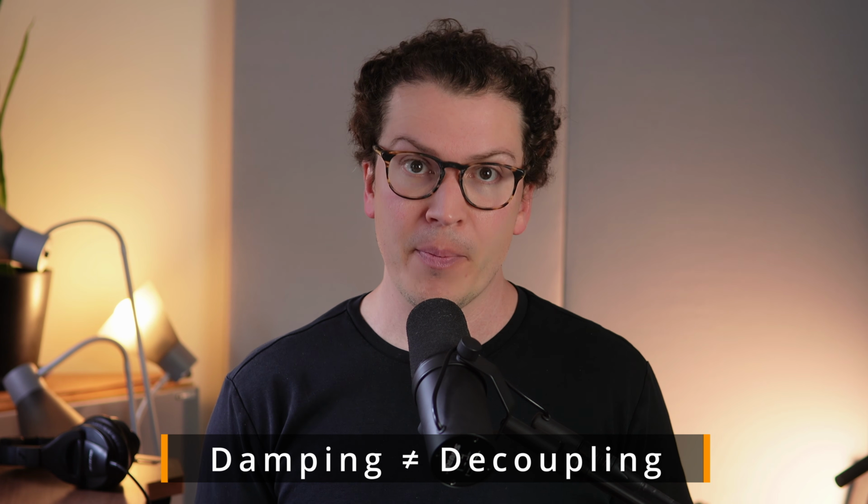So the first thing I want to talk about is, what is green glue actually doing? Green glue is working as a dampening compound. It's a viscoelastic polymer, to get super nerdy and scientific, but essentially it's turning vibrational energy in the drywall into heat. If you can imagine in your mind, sound hits the drywall layer and starts vibrating it, that vibration transfers to the sticky green glue layer in between the 2 layers of drywall, and that vibration gets turned into heat by the green glue compound, and then less sound energy transfers to our second layer of drywall and then into the room. That essentially is how it works.